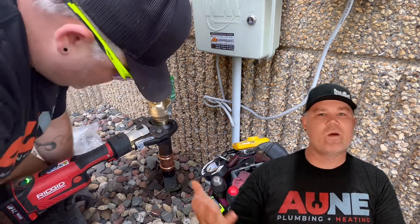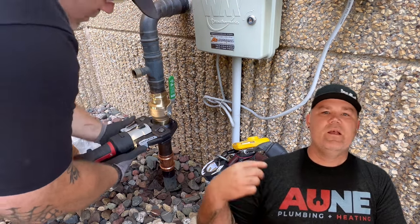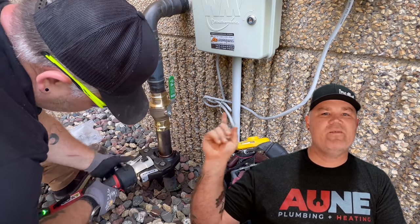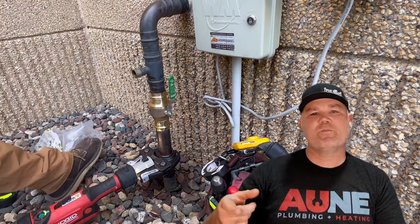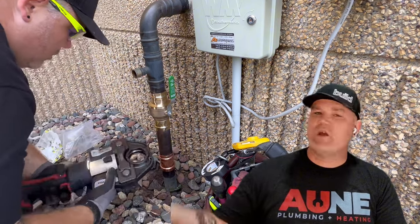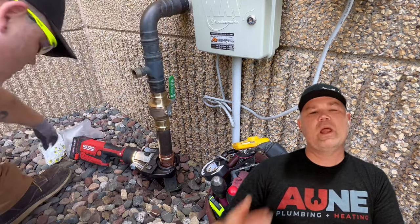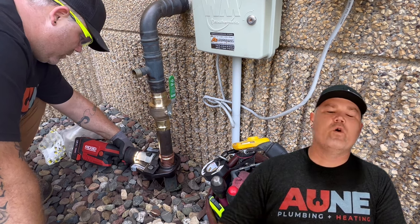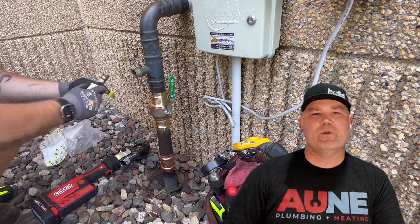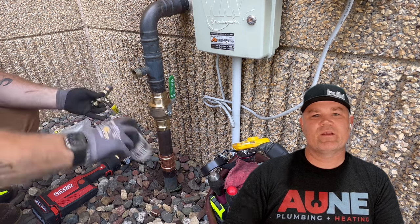They're very expensive — I don't want to make a mistake. Press that underside of the valve, and I just have to press the coupling, and we're going to be just about watertight. Earlier in the video I replaced that PVC plug that was in that T — that's a test port for the irrigation or a winterizing port. They're going to hook a big air compressor up to that three-quarter inch plug in that T, in that female adapter. Now I'm going to replace that PVC plug with a full-port ball valve — a brass ball valve with a little brass nipple in it, lever handle, garden hose thread. It's a really nice little Webstone valve I like to keep on the truck.